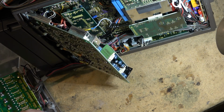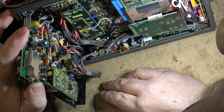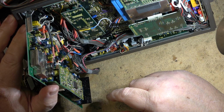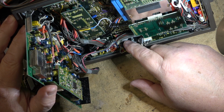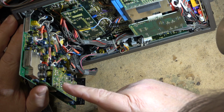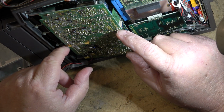Linear audio still has no sound. And linear audio is probably more important than hi-fi audio, because I would imagine that the owner of this unit is probably using it to try to copy tapes. And not every tape is going to have hi-fi sound, but it still should be processed on this board. This is the audio board.